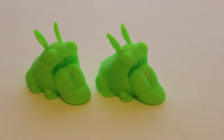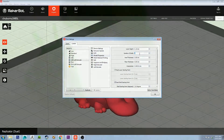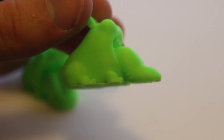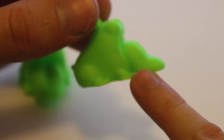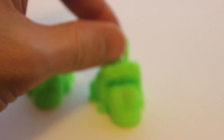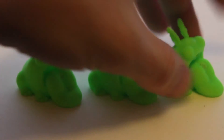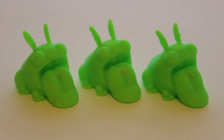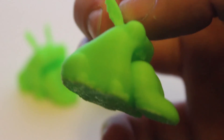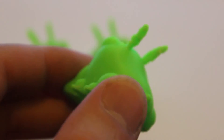The result of increasing extrusion on restart was quite a bit better. I also solved the problem by increasing the number of shells — that's basically perfect; I haven't cleaned it up perfectly but it's very close. However, I was getting some over-extrusion on the underside of the tongue and also over-extrusion on the ears, making them too blobby. That was the second attempt. The third attempt, which I just finished printing, still has a bit of blobby ears but the over-extrusion issue on the tongue is almost gone.